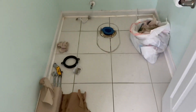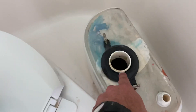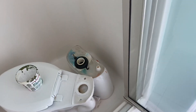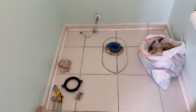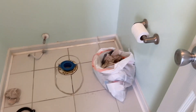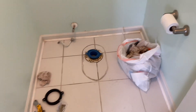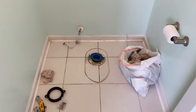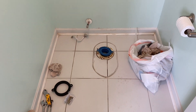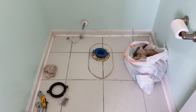Last tip I'll give you — we swapped out some toilets one time and we actually just replaced the internal parts on about four toilets. We didn't get them cranked down good and tight. Everything looked good while we were there, but the next day the customer called and said that they had leaked and there was some drywall damage. I had to go in and fix all that. So now I'll dry everything up real good when I'm done. I'll take two or three pieces of toilet paper and just lay them back in the back, and I'll ask the customer — if you don't mind, later tonight or tomorrow morning, go check that toilet paper and make sure it's not dripping or leaking. I've never had anybody complain about that. I think people like it — it's due diligence.